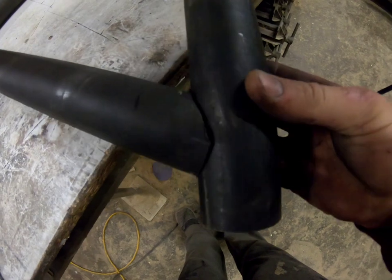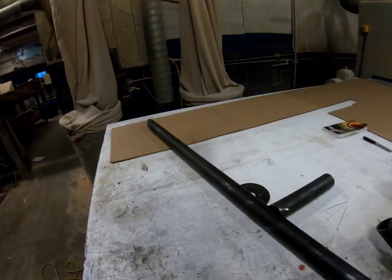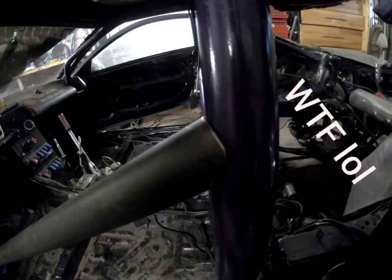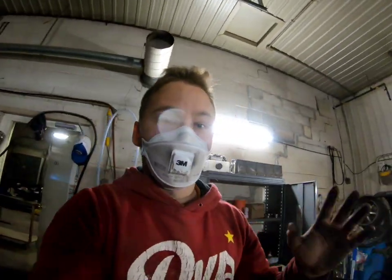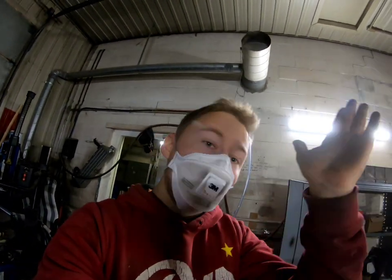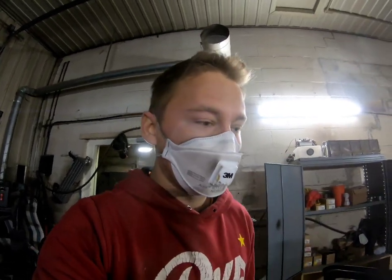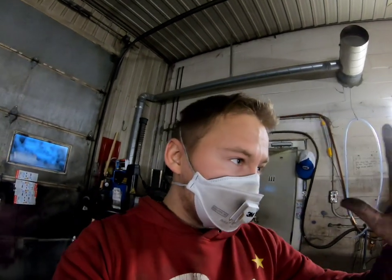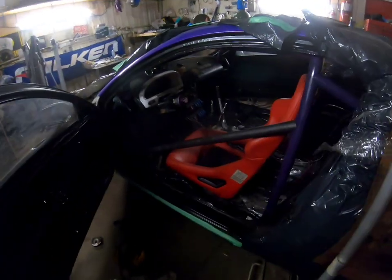I got it fitting pretty good — there are still some gaps but both ends are done now. Holy macaroni and cheese ball — it fit first try! I don't know how — might be skill, might be luck. That theory does work: cutting it a half inch big, having lines to the horizon, then tweaking with the grinder. It will fit if you made the right marks — and it can be done with just a grinder.